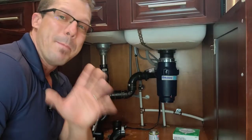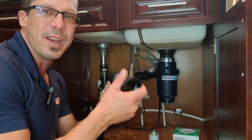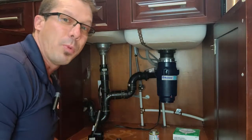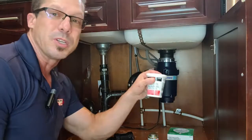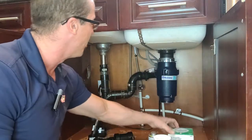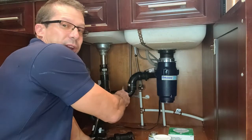I'm back from Home Depot. I got all kinds of pieces. I needed a little piece to hook up the dishwasher line because it's hooked up to the garburator right now. I've got some glue for the ABS, some plumber's putty for when we put it under the sink, and my little saw because I'm going to have to cut some pipe.